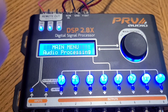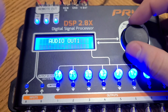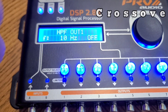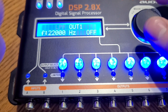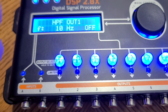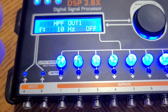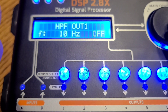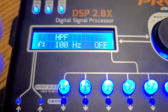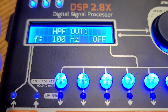Now that we've covered all the basic features, let's get into what everybody's waiting for: how to set the crossover and the gains. Inside the crossover, this DSP will allow you to set both high pass and low pass filters for each individual output. This is a very good tool to get your speakers playing exactly where they need to in the frequency spectrum. A lot of analog crossovers will only allow you either high pass or low pass — this gives you both on all outputs. We're going to set the high pass. Let's say we're working with a mid bass speaker; we'll put this up to 100 hertz. Now as long as it says off, you have no filter — that 100 hertz doesn't mean anything unless you have a filter set, so it will play all the way down to 10 hertz.